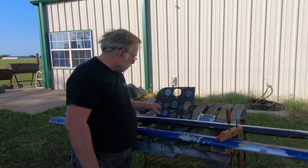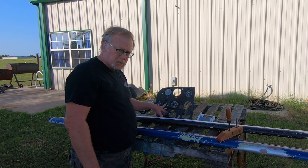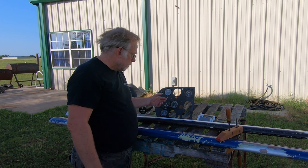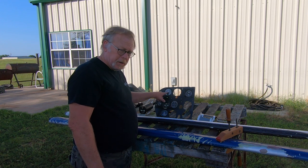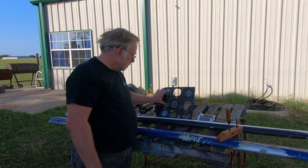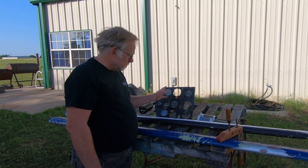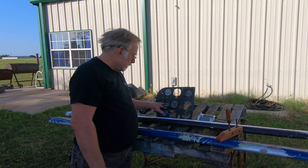The DG was vacuum powered. And then the turn coordinator on this aircraft is electric. So that's how Cessna separated systems. If you had a failure of a vacuum pump, then you would still have an electric turn coordinator. And you could do needle, ball, airspeed and still keep the aircraft level and stay alive. So that was the deal there. If this went out, you'd still have your horizon vacuum system and all that. So single order failure, and you could get that fixed.